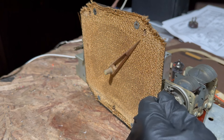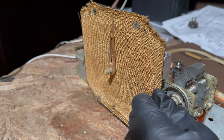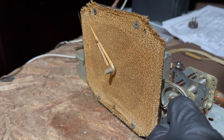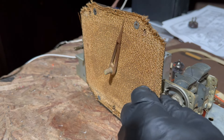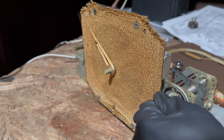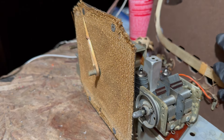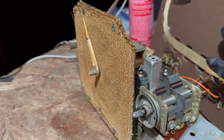This is a vernier tuning design — it's got a smooth, slow tuning so when you turn the knob it doesn't just spin all at once. I could use a little oil in there — just a little, I don't want to put too much. Well, that's smooth now. I also forgot to clean the phono switch, which needs to be clean. That should be pretty clean now.